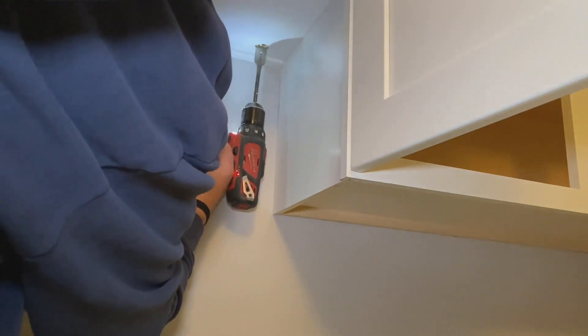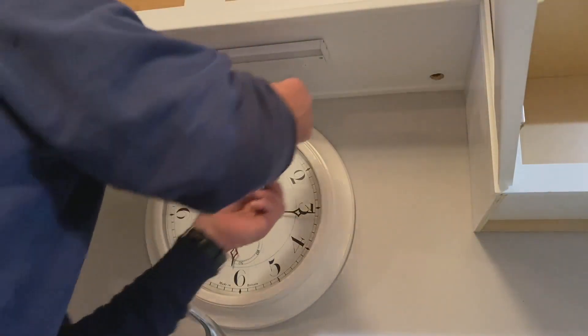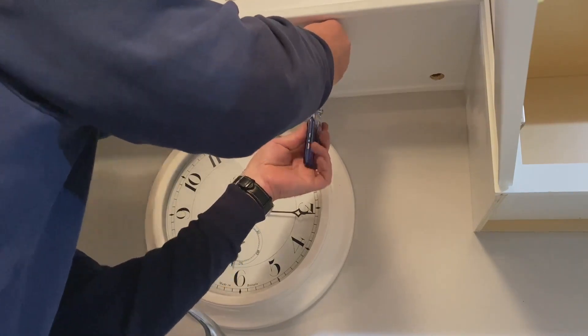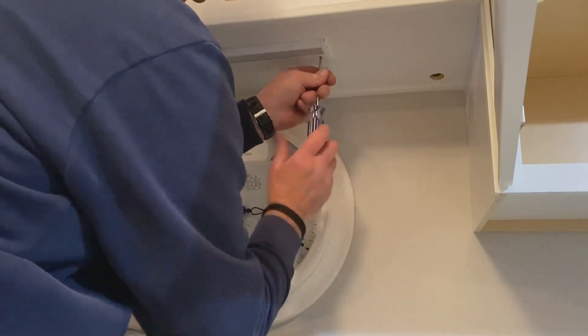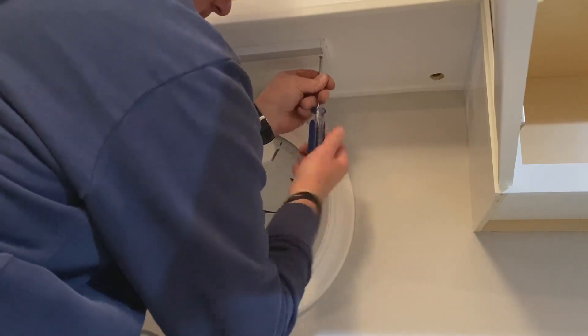Now Lauren, you're a little nervous. Yeah, I'm rescinding my previous answer. It's just that simple. Here's the fixture — it's just a small 16-inch fixture that you're going to screw into place, and it just comes with two screws. I like to do it by hand, not with a screw gun, because you don't want to break the fixture, and so you tighten that up underneath the cabinet itself.